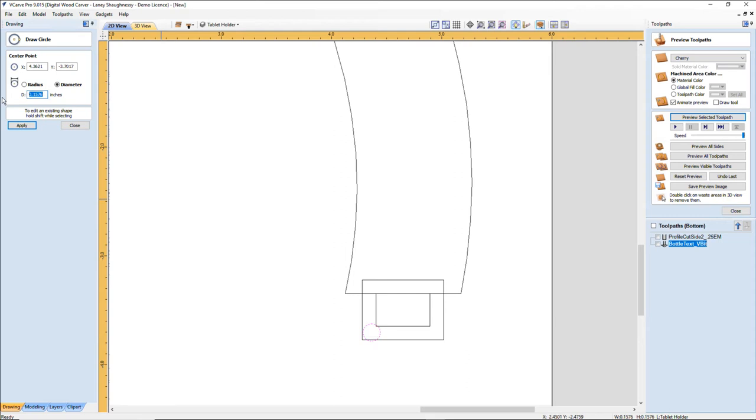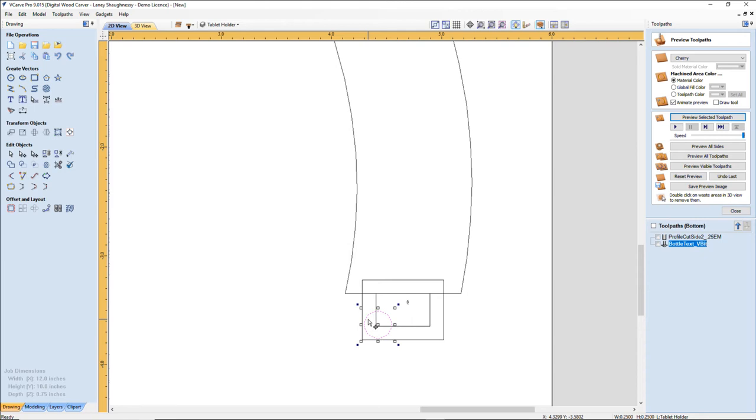diameter bit is cutting, it's only going to be cutting inside this pocket, right? So it's going to be milling here. It's going to come to this line. It's going to mill over to here, and that's all I care about, that I'm cutting this tenon right there. Now, I do not want it cutting into my part up here, right? So we're going to grab this, double click on it, grab it right in the middle, and snap right down to that line. And I don't need this much width, so